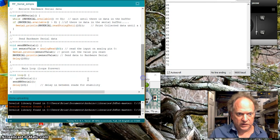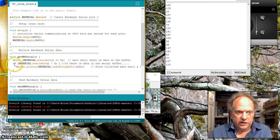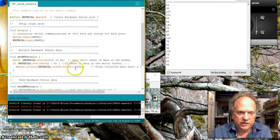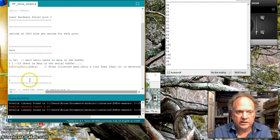Now let's look at the receiver code. We're going to switch it over — comment out 'send' and use the 'get' function instead. It creates a loop: if there's nothing in the serial buffer it waits. If the buffer does have data, it runs the command to print what it collects. This uses a cool feature — readStringUntil — and it's going to read until it gets a value of 10, which is a line feed in ASCII. So we're looking for a line feed as the terminator.